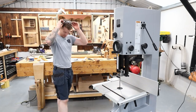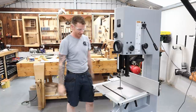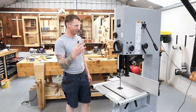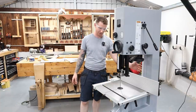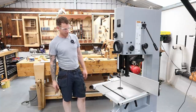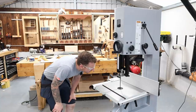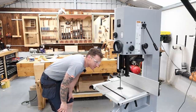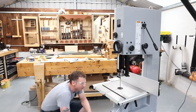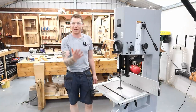We're plugged back in and safety goggles on. Just going to give it its initial run to make sure nothing is caught, the blade is good, and nothing comes flying off since we haven't tried the new blade yet. That all seems pretty good. Let's check how it's tracking and have a look at the bearings to make sure nothing is touching. All good and happy days. We are now ready to make our test cut.